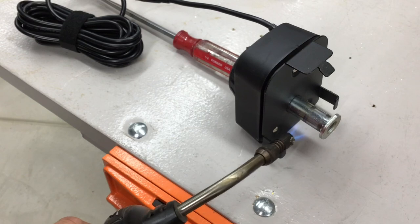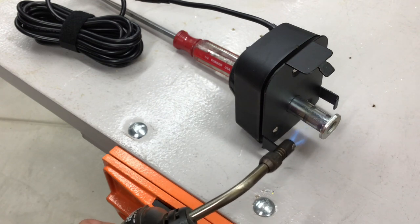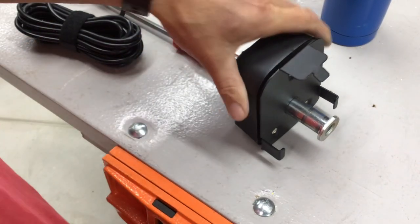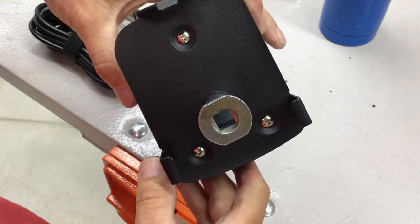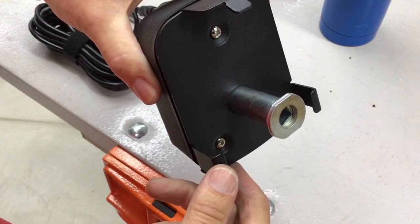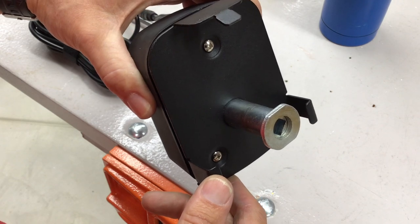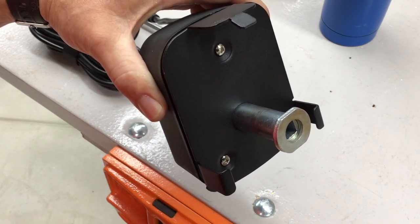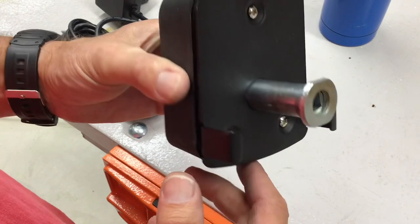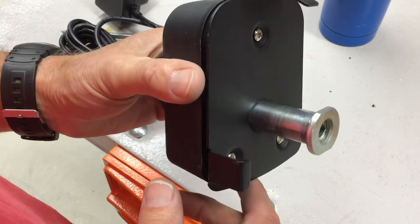Let's try it out. I'm applying a little heat — just as if it's getting warm in the grill — to see if it expands and gets hung up. It appears to be working. Plenty warm. We're not tight. I almost feel like I want to take a little more off, but I don't want to overdo it. I'll take just a tiny bit more off and call it good. Plenty warm from the grinding and the flame, and you can see we do have a little bit of a gap in there — I think that's going to be good enough.